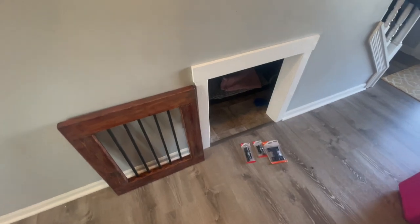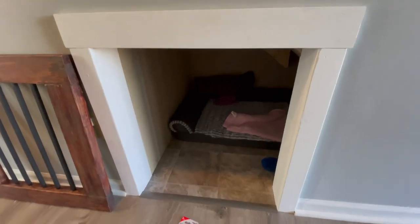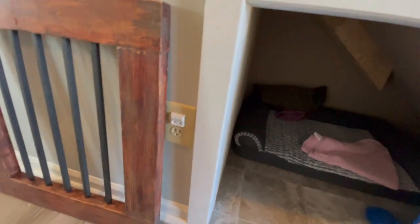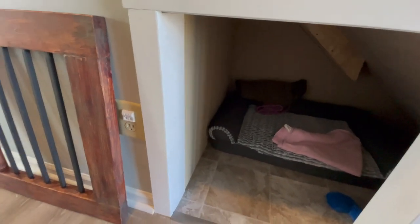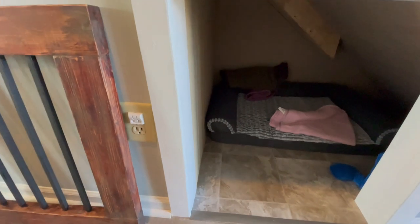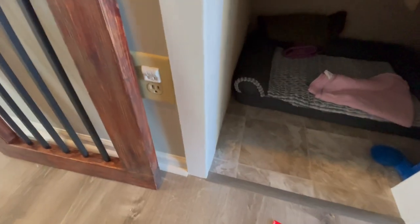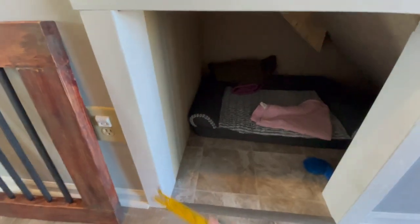All right, we're into the second day on this, and I wanted to share with you a few things. One thing with this opening was I was faced with this outlet being super close to the trim work, so I knew I was gonna have to go with a skinnier piece of trim. It actually is a little wider than a regular door casing trim. I'm standing by one right now, and it's 2 1/4 is what a normal one is.